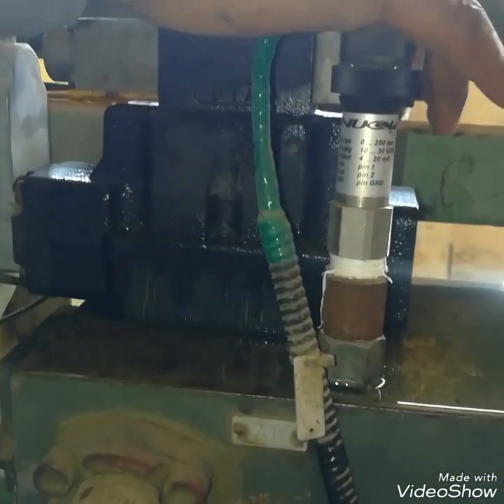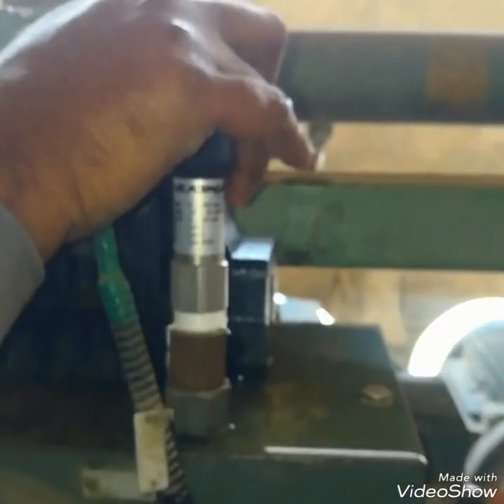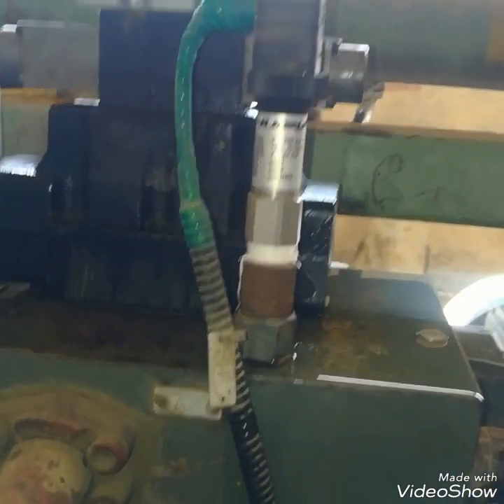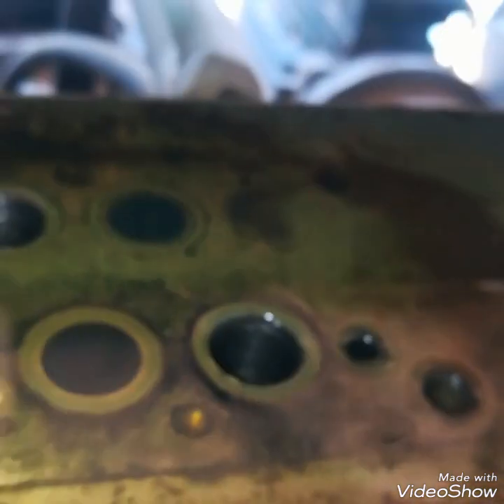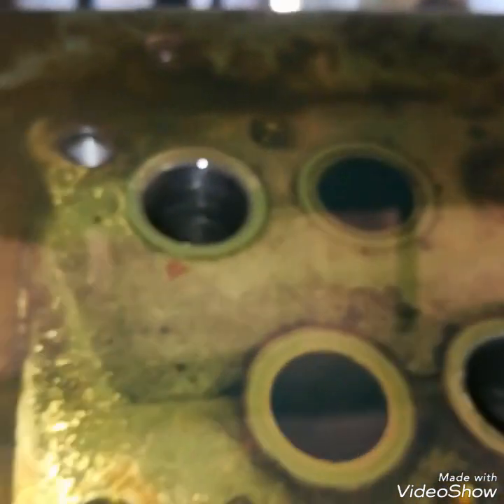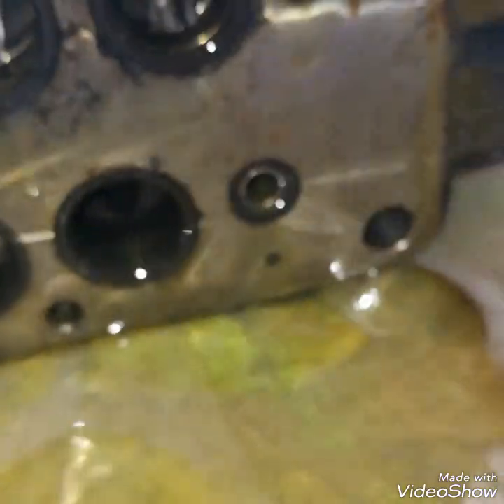As per the set point, it gives the stroke to the jack. Now I am dismantling it from its mechanical block. Here you can see there is a dust-type material inside and the oil is not clean. I will clean this block. We also need to clean the proportional valve body.